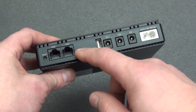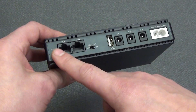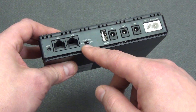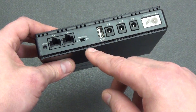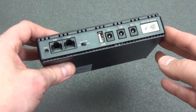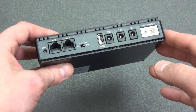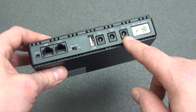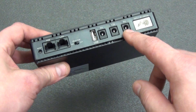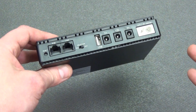There is also a switch for the POE port voltage — 15 or 24 volts — since different cameras can have different input voltages, though 24 volts is the most common. Next is a USB port, where you can either connect a smartphone for recharging or provide guaranteed power to a smart home device, such as a Zigbee gateway or temperature sensor with a 5V power supply. Then there are three outputs for connecting devices with different power supplies: 5 volts, 12 volts, and 9 volts — the most common voltages for a router, GPON terminal, switch, and camera. The last port is for connecting power to the UPS itself.